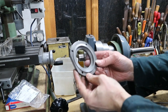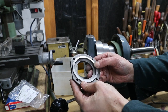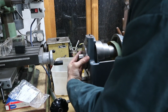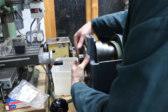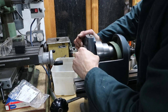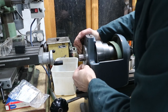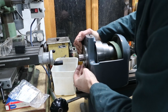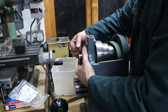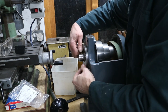We've machined the surface and I've taken off 0.23 of a millimetre. Assembling that back onto the machine - onto the headstock - and tightening it up, I can see even before I've put the screws in that we're going to need to take off some more. Just not quite there yet, which is expected.